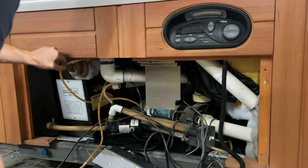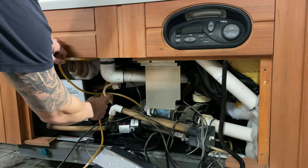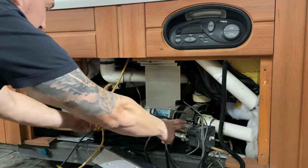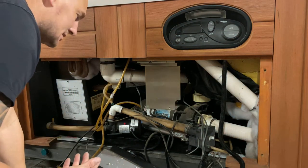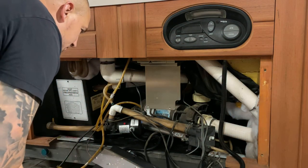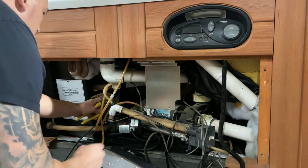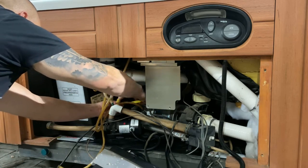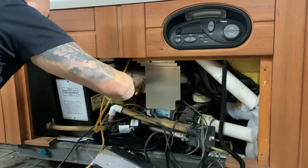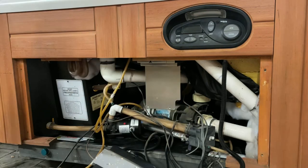These little bleeder nipples that come off the circ pump are very fragile, so if you can remove this piece of plumbing just to be careful so you don't bump it, that's a good idea. We're going to remove this piece of plumbing right here. I've got my channel locks and I've used those for the pipe clamps — those are off now. I'm going to go ahead and turn my heat gun on.